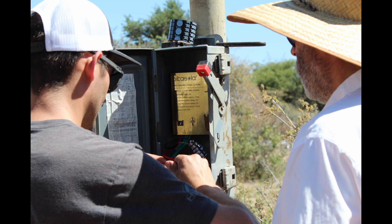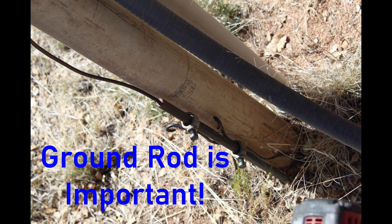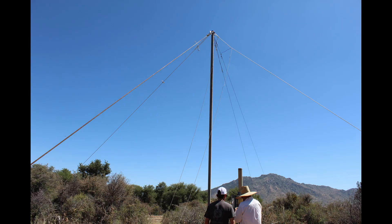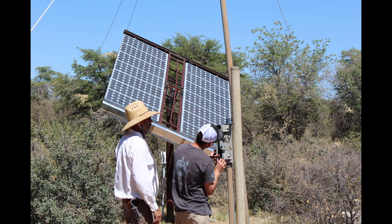And that ties into the solar system and the batteries and the inverter. Here's the eight foot ground rod that keeps things safe. This is how we attached our hoist point and I'll explain more about that a little bit later. This is the gin pole — this gives you a lot of leverage when you're raising up a mast. You can see some solar panels in the background.